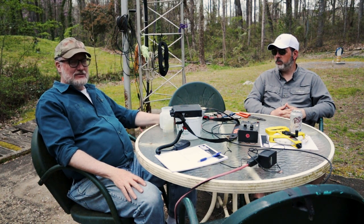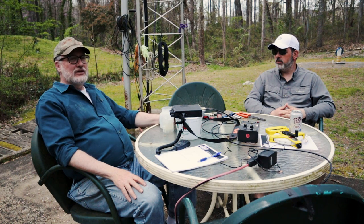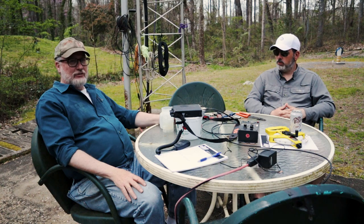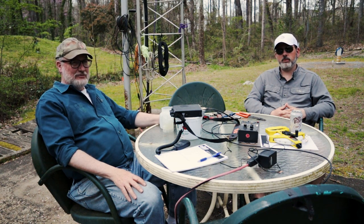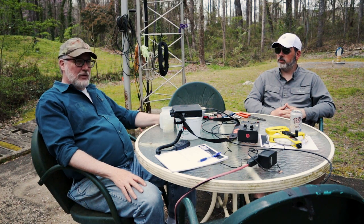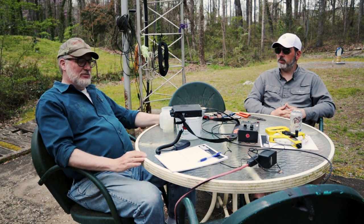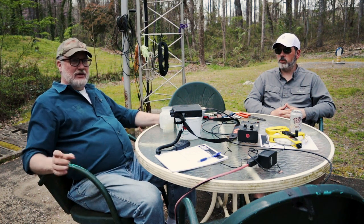Yes, and we weren't planning on running a lot of power. We didn't expect to have extremely high voltages at the end. The other thing to consider, we're using Dacron rope. It is hydrophobic. It doesn't absorb water. It acts like a pretty good end insulator all by itself. In any case, the purists would probably say we should have done something different. But one of the things we wanted to do was make this a simple antenna that anybody could build without having to order a lot of stuff online.